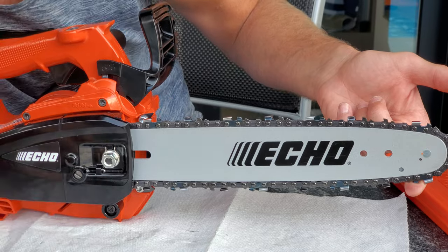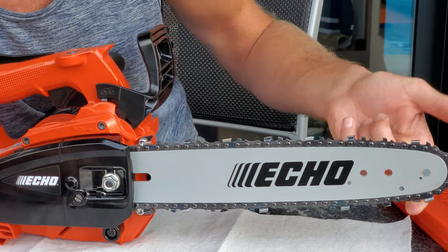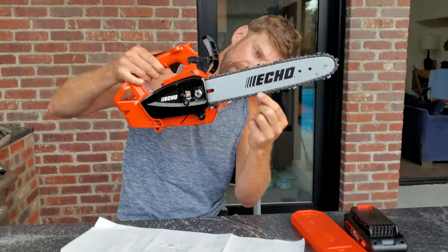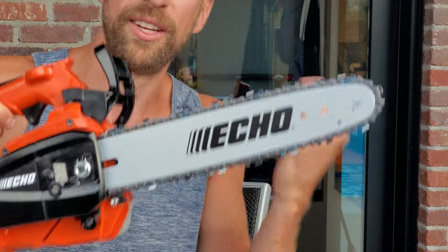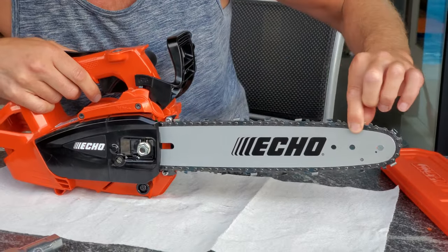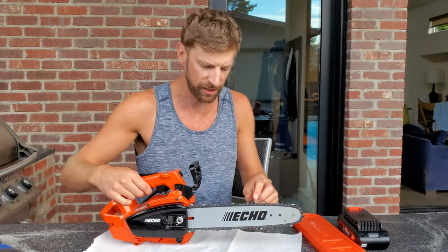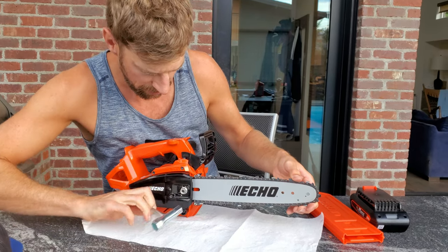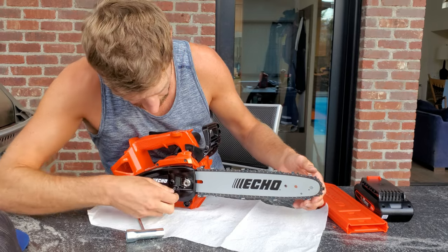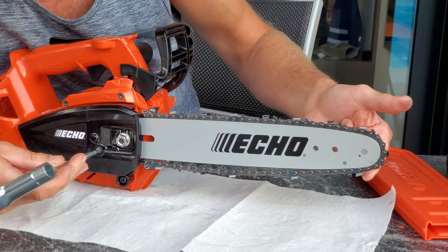Take a zoom in — I'm tightening it up, it's raising. Boom, just touches the bottom. Now I'm going to tighten it, holding the bar tip up. You can see the gears under the chain; you can still pull it down slightly. Now I feel resistance — it's not like it used to be. It feels a little tight overall, too much resistance. That's a little too tight, so I have to back it off again — finger tight, wiggle it up and down, and back this off. You pretty much have to start from scratch every time because you've got to let the chain drop.